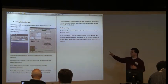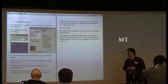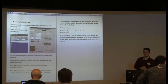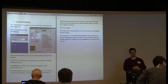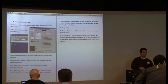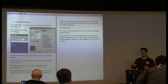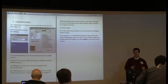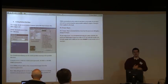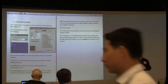We're going to send a couple of commands directly in the terminal — just type them right at the top. First is MT, that's mode torque, which sets up the motor to do a torque move. A torque move is an open-loop move — it's not monitoring the encoder. So if you put your fingers on the shaft or put a load on it, the motor speed will decrease.